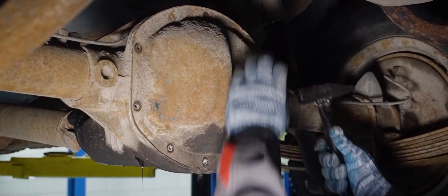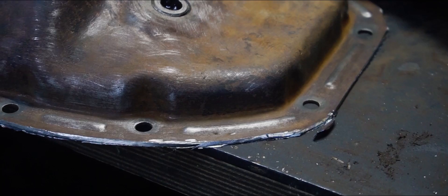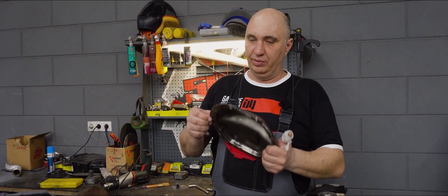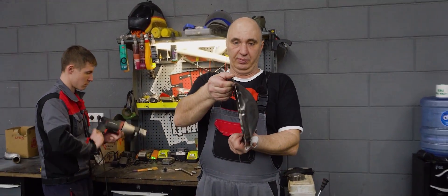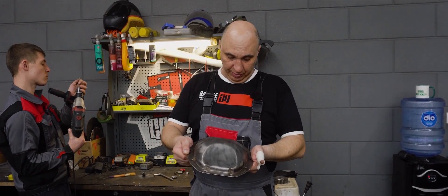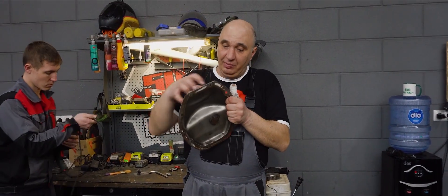We've prepared the cover and it's looking very good. We did have to cut the edge slightly in order to get the right shape. We're always having trouble with the edges, given they're at a 90-degree angle — see how sharp these are? This means we need to drill some holes in order to get some vacuum happening, so that the plastic wraps itself onto the piece as tightly as possible. If we don't do that, it'll assume a 30 to 45-degree angle and not get all the way to where we need it. So we'd definitely have to drill a bunch of holes so that it gets sucked on and the shape is covered nice and tight.